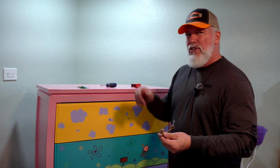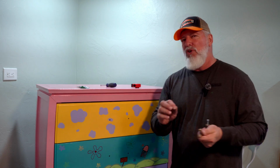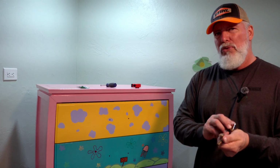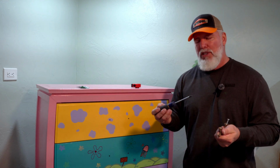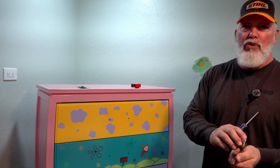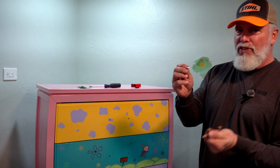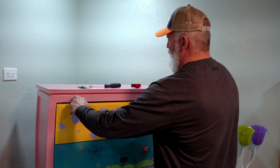One thing that I would suggest if you're dealing with these screws, there's 2 situations with the screws. If you're using especially an impact, even a drill, if you're not careful, you will strip the head of that screw out. I suggest on these, they're very small, you're not going to spend much extra time, go ahead and use a screwdriver. That way you will not mess up your screws, all right? The other thing, this is the screw that they sent with this package.